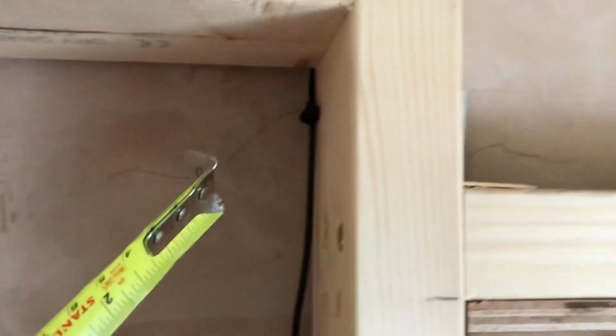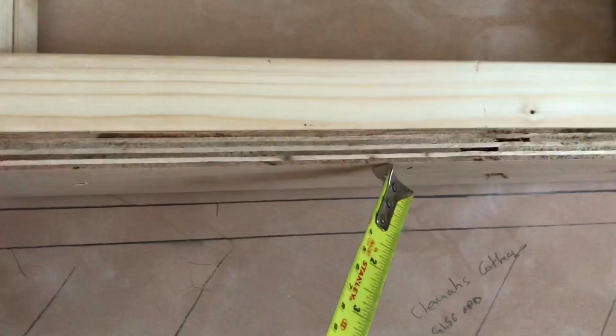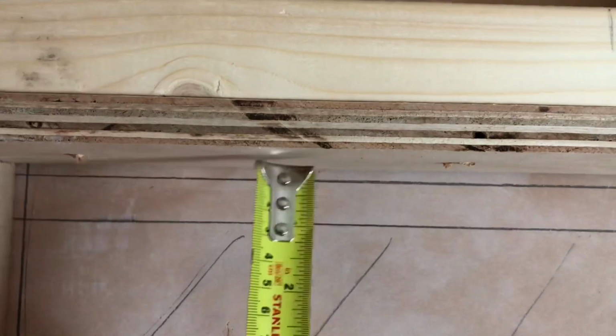because this is just going to get boxed in. And then the first light, I've just texted the client, I'm wondering whether to do them equally spaced, so you'll have 3 gaps the same, or do 1 in the centre and then 2 sort of either side. So I'm just waiting for her reply. But I'm going to oversize these holes 35, then the plumber can do 25mm and then just clip the light back in. But I'll get this all sorted and then we'll show you the end result.